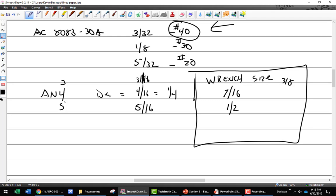So to get from fraction to decimal, right here there's a little thing that says F to D. It's in green, so it means I have to turn on the green keys. Look up here at the top where it says second. That's in green. Push that button, and all that happens is it says second right there. Nothing's happened yet. Now I'm going to hit that arrow key, which means F to D, which stands for fraction to decimal. And it goes 0.4375. That is the decimal equivalent.